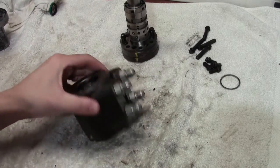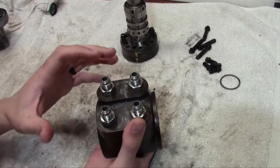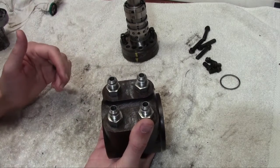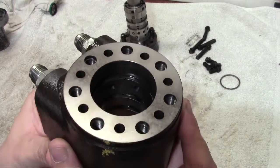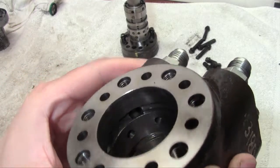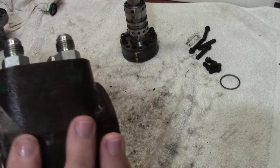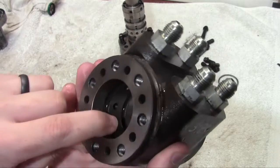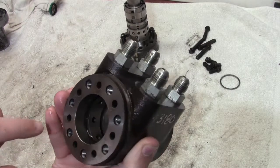Now that we've got this thing apart, the main component here is this manifold. That's got your in and out ports — your pressure pump in, then return to tank, and then left and right to each side of your cylinder. That's pretty much all this thing is. You can see some little holes drilled in there — that one goes up to that port, and there are some right there going up into this port. The two for the left and right are actually inside here in these two valleys, and then you've got the whole bolt pattern drilled right there too, which appears to be connected to all these holes here in the manifold. That's the way those work.